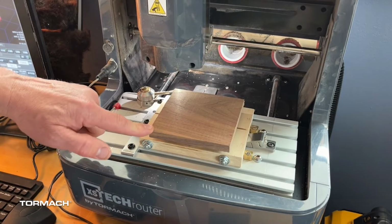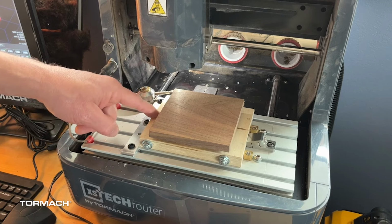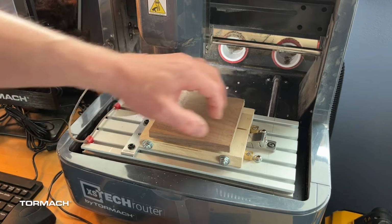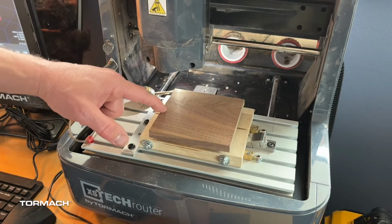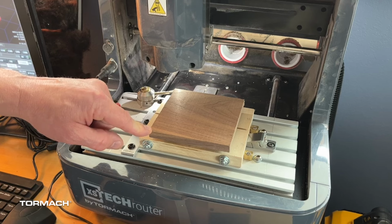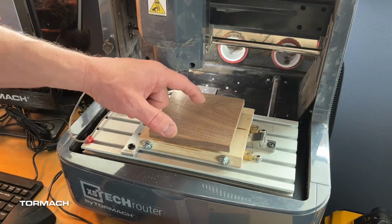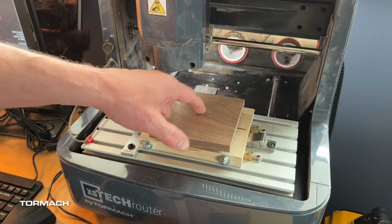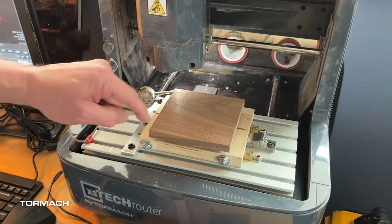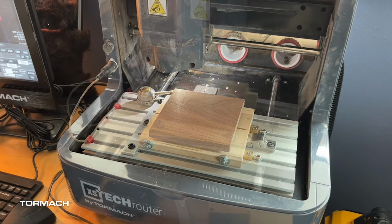All right, so this is my original corner that was originally in this place. We have it in our compression clamp. We've got this settled down, so now I'm just going to go ahead and use the same end mill. Number 3, we're going to reference it off this corner. That way we'll have our same 57.5 by 57.5 in terms of the center. We'll just double check to make sure that it's square, and then we'll set off our XYZ coordinate right here. So let's go ahead and get that set up.